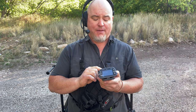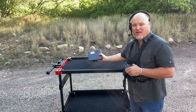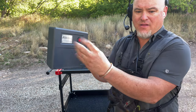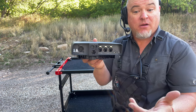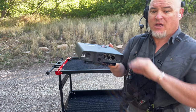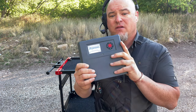This is a system that is not peer-to-peer — it's not pack-to-pack. It has a base, and that base is here. This base is making the RF signal that goes to the belt packs. It can be powered with a 4-pin 12-volt power supply from your block battery or from your NP batteries. It is meant to be DC-powered primarily, but it can also be powered via Ethernet if that is convenient.